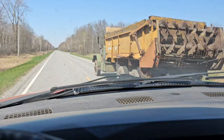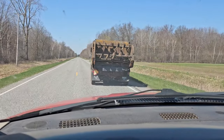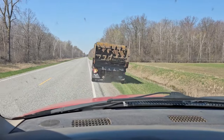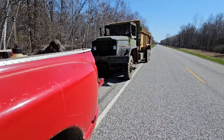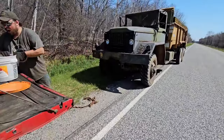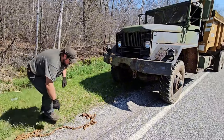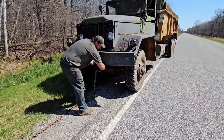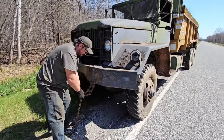Looks like we're breaking down. Well, we made it halfway. So what do you think happened? We're running out of fuel. I had to hold the choke all the way out to make it this far. Is the tank empty? Nope. Really? We got plenty of fuel, but either the carburetor's clogged or the pump's not pumping.